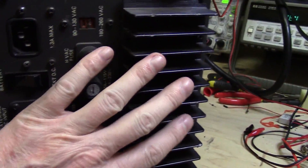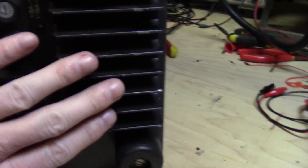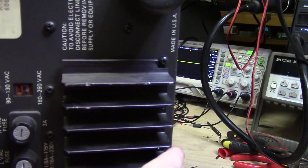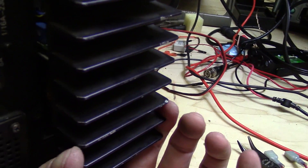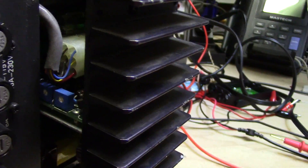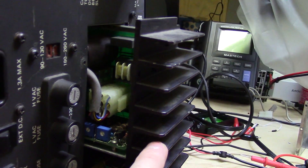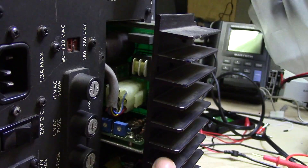Just to give you a quick idea of how to remove this power supply: if you look on the back there's a big heat sink, and there are actually a couple more screws in there, but the only four you need to worry about are the four in the outside corners. Once you remove those, just wiggle and give a little tug and it'll come loose — but don't pull too hard. There's a connector you need to remove that's connected up to this section here; that'll let the power supply come all the way out. I'm already suspicious of the caps — I see some discoloration.